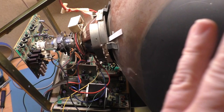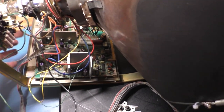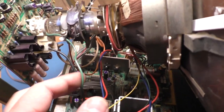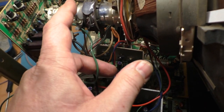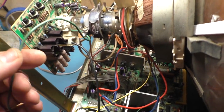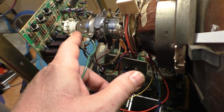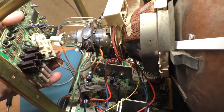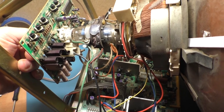All right, so this is a U5000 tube, so might as well put a U5000 on it. So we have a working, known good U5000 installed. I have the neck board back on. I went ahead and secured the wire to the screw here of the brace for the convergence ring assembly. So now we have a stress relief or strain relief, so it just wiggles back and forth on here and does not put undue stress on our actual solder joint. The neck installs with ease. You can see it comes right off and goes right back on, and we're still secure.